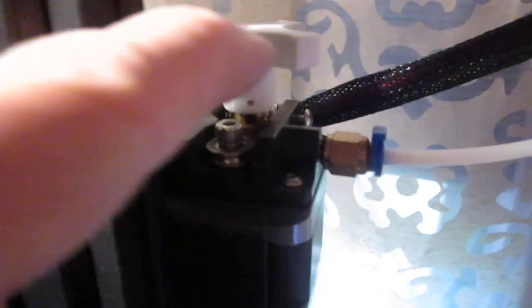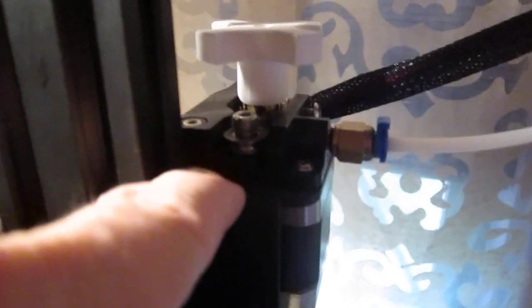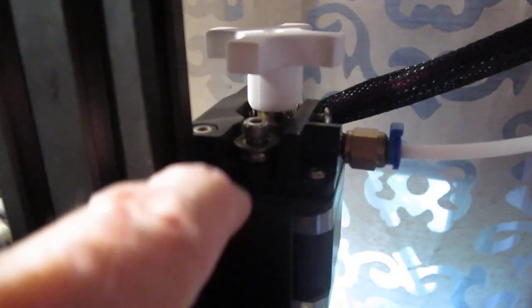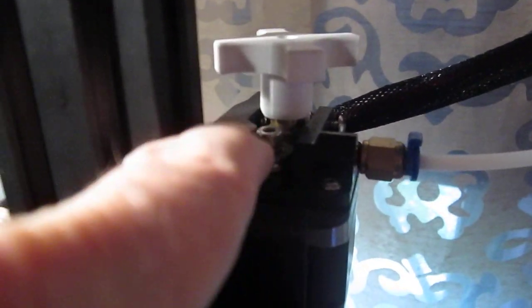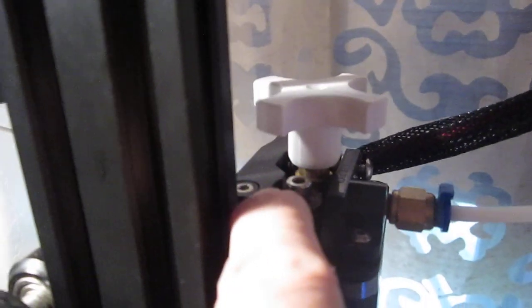Okay. You can see it's the plastic extruder. And the reason I point that out is many people change to the metal extruder and constantly have issues, it seems like. There's always posts about how the E-steps are set up, the springs, the gears, and all the stuff that's associated with the aftermarket metal one. I don't have to deal with that. I never will. This works. It was designed for this printer, and if you do have an issue with the arm here, what they're told is, oh, replace the whole thing. That's wrong.